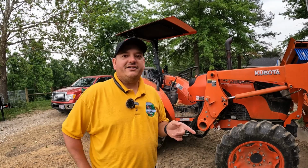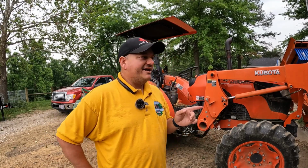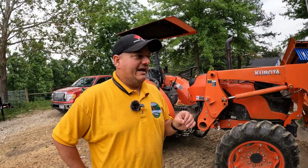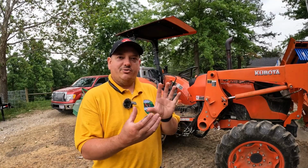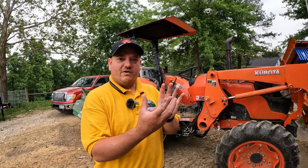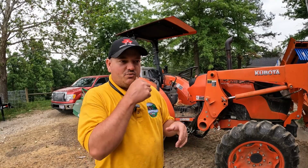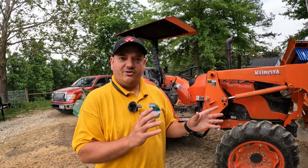One thing that I might end up changing on this though, I might end up putting 2 casters on it that are just the straight casters instead of having all 4 of them swivel casters. And that's because I noticed whenever I would go to push it, that if one of them's turned sideways, then it takes a little bit sometimes to wiggle that and make it turn around to where it'll roll straight. So I may change that to where you just basically steer it from one end and the other end is just straight. I think that'll actually work out just as good, or maybe better, because it seems like I'm fighting those casters turning a little bit.